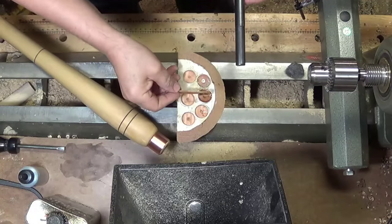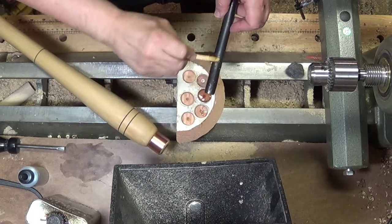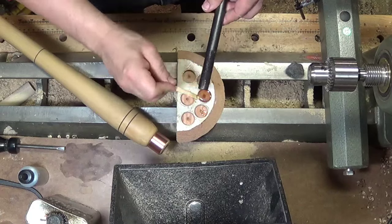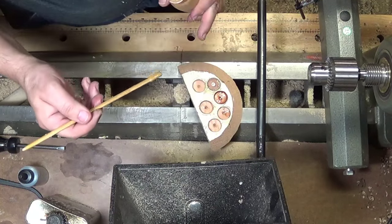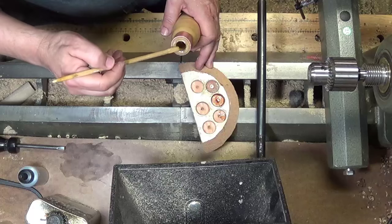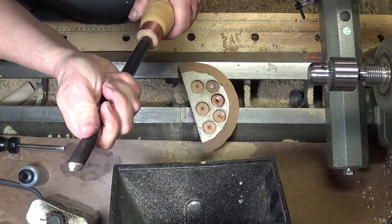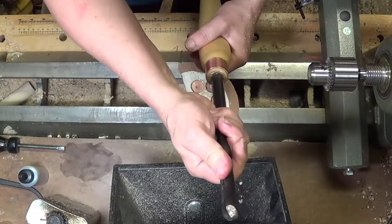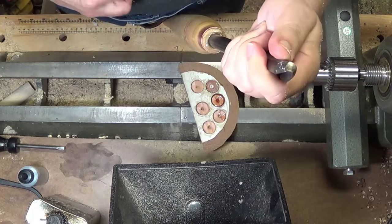And I've got my epoxy mixed. So I'm going to rub that up back and forth on the shank here. I get all of it to have at least a little bit on there, including the end. Okay. And I may have to actually clamp this in place somehow. Yep, looks pretty good. And I'll keep a little pressure on it until the epoxy either comes up or goes further down into the grain.